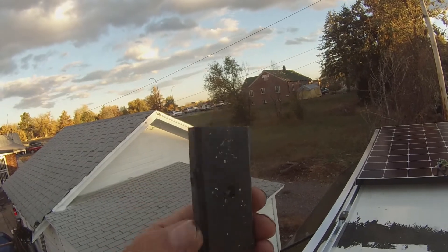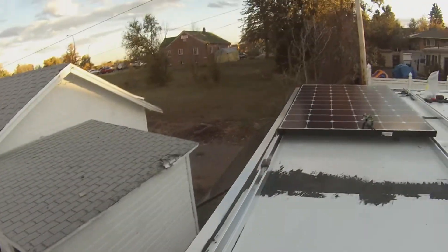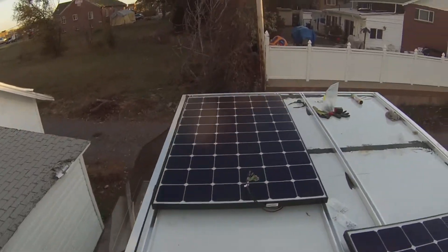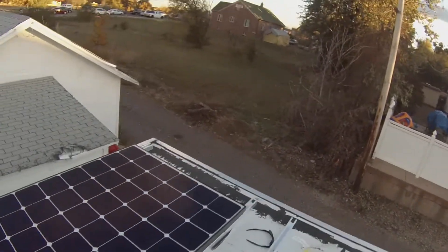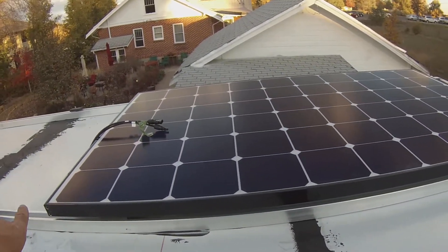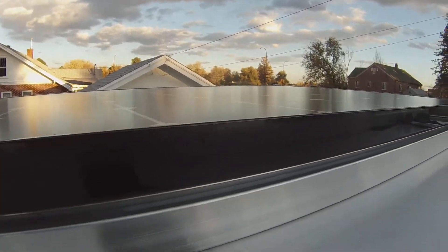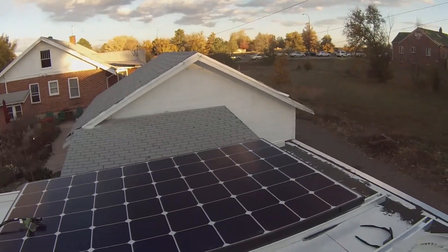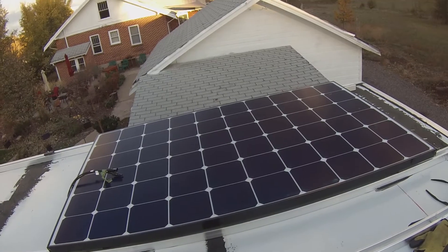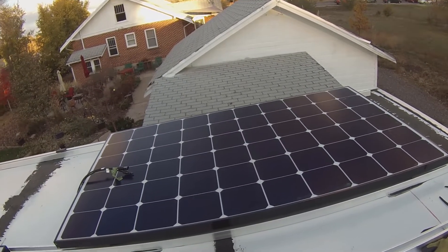To minimize vibration I've added these Teflon guides designed for large equipment - they're the right thickness and width to take some of the shock out of these panels. They also give me an air gap, because had I mounted these straight to the rails I would have no air gap between the rail and the solar panel. These panels become less efficient the warmer they are, so the more airflow I can get underneath them the better I'll do for efficiency.